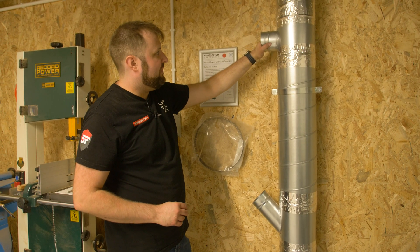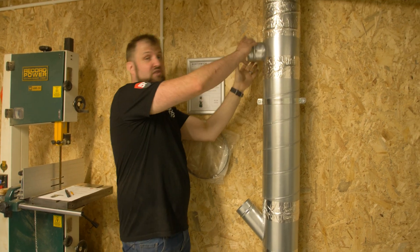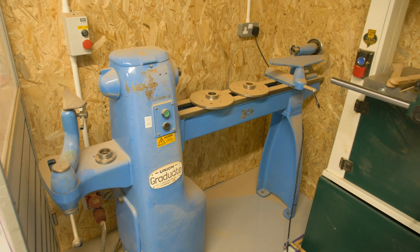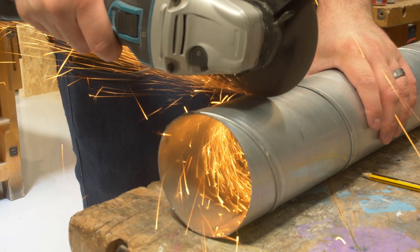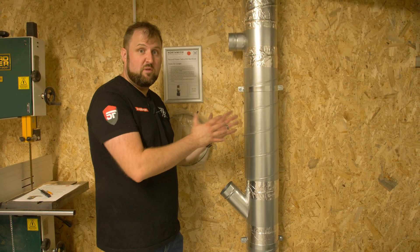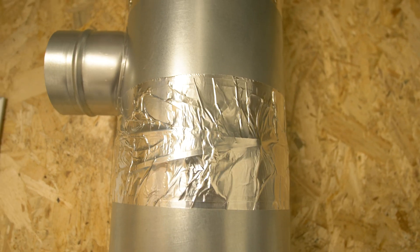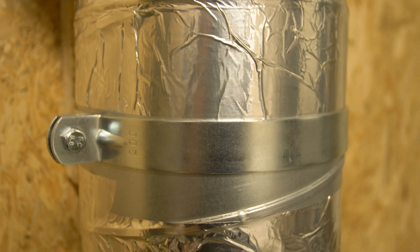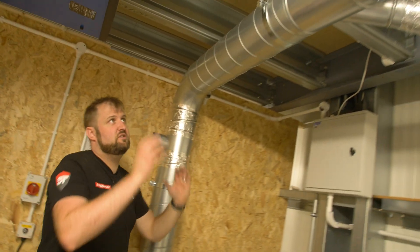This is just a standard elbow — I think they sent me this in error — but we've made it work. It's going to go across and dip down for the wood turning lathe because that's going to be like an open mouth. This one is in line because it's going to go up to the bandsaw. When it comes to ducting it's all pretty much just cut to length with a grinder — measure the length, cut it, slot it in place. Once we're happy with the positioning we use metal tape for the air seal, wrap it around twice and mould it into place. We've used brackets to fix it solidly, and as we've done each piece we've made sure it's in the right position before adding another bracket.